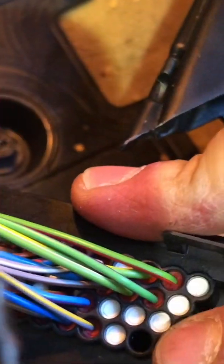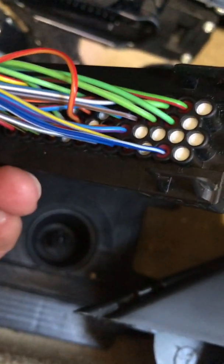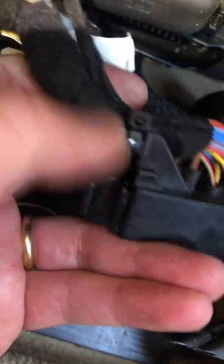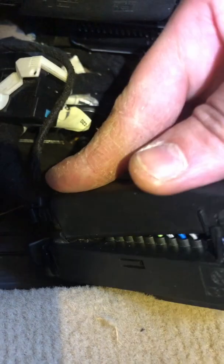Take the blue one — it's pretty hard. Make sure it goes with pins upside and downside. The first one is in; the red wire is on hole 19 and the blue one is on hole 13. I have put another zip tie here to lock my wires and now I have to put the cap back on. First I have to align this hole and make a little click — so this goes here.